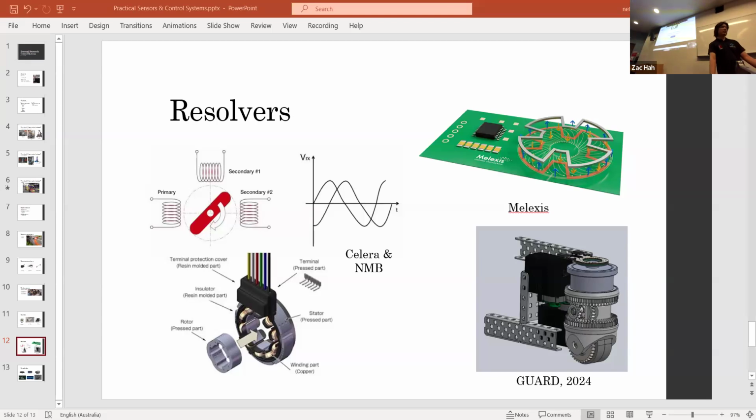I'd probably avoid, I know we want to be price conscious, but I would probably avoid getting grey market connectors and things. We bought Anderson Power Poles, like PP45s from eBay, and they'd be a quarter of the price that you'd normally pay for them, but then they'd melt. So yeah, 100% agree. I think with connectors, you want to buy the real deal. You can get away with not buying the expensive crimpers, I think, but at least for the connectors.